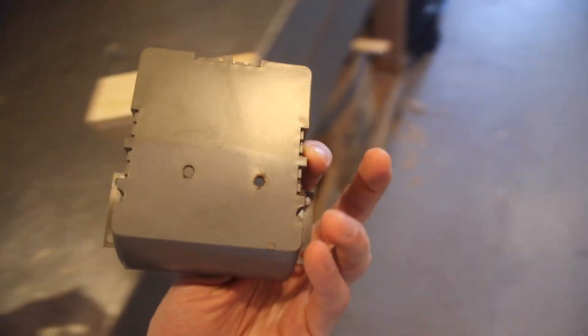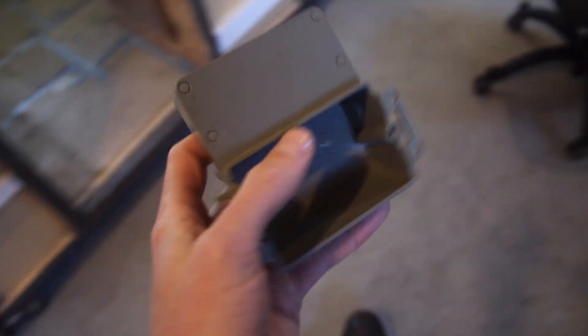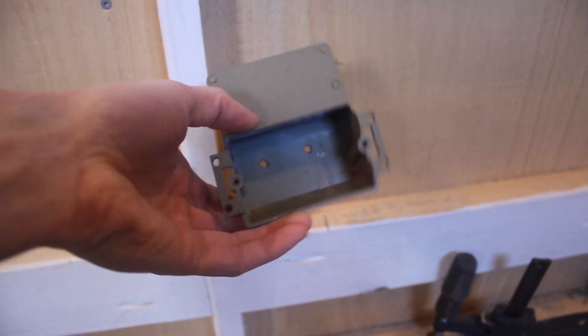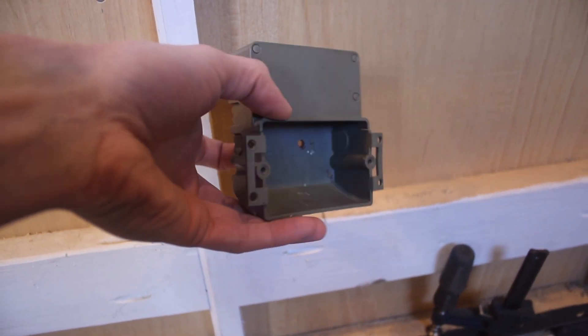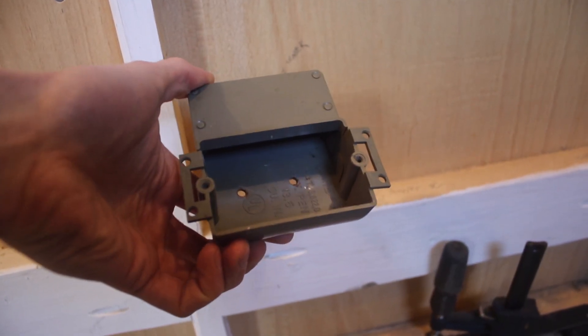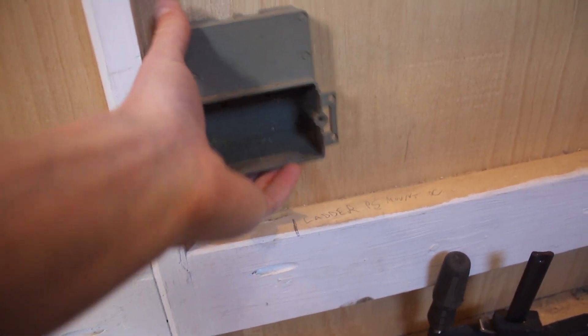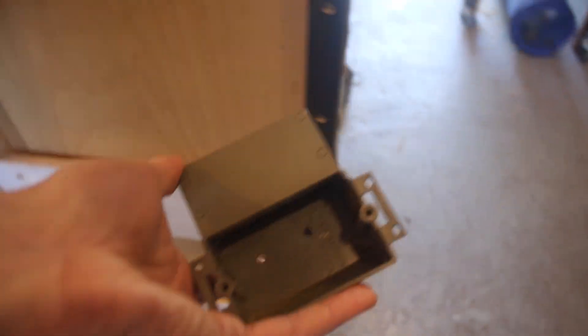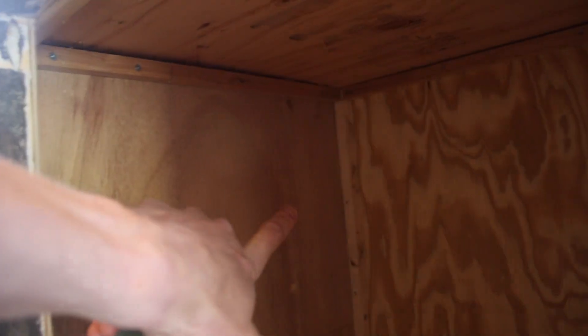I'm going through all this electrical and trying to salvage the most I can from the existing old camper to get the new electrical set up — and I'm talking 120 AC electrical right now. This was the exterior receptacle box mounted on the old camper. I marked the location — it's an estimate. These screws need to bite into something, so I've got to put a little backer board back there. We're going to install that now.